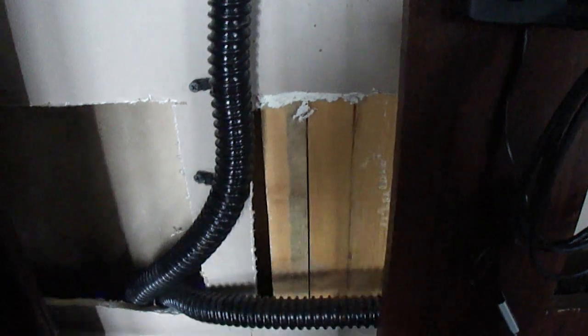Here's where I came through the wall from the basement to the sump. I found my stud right here, marked everything out. I went to cut the line here coming across and I found five two-by-fours all next to each other, so I had to just move the hole over to the other side of the stud.